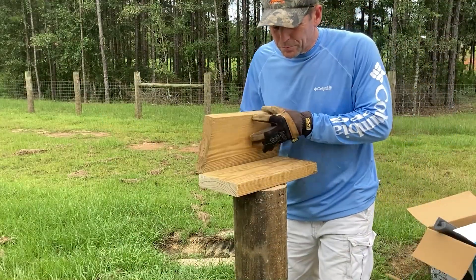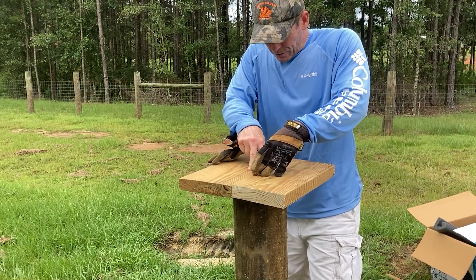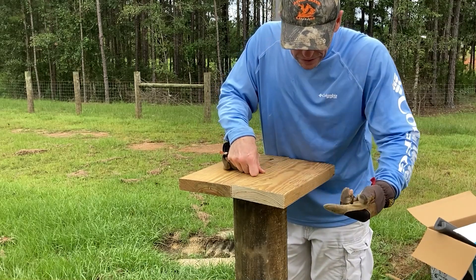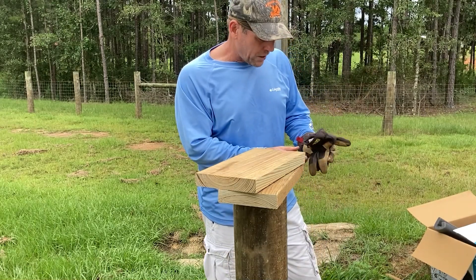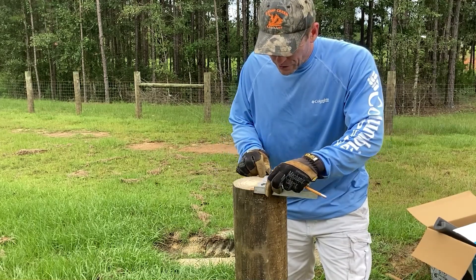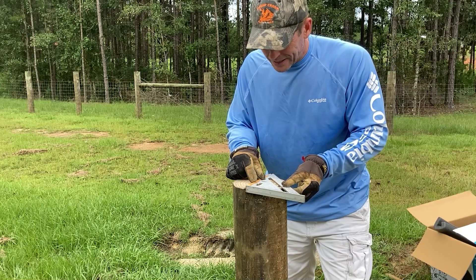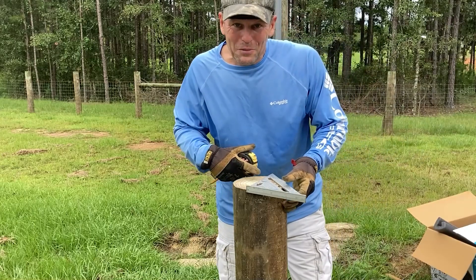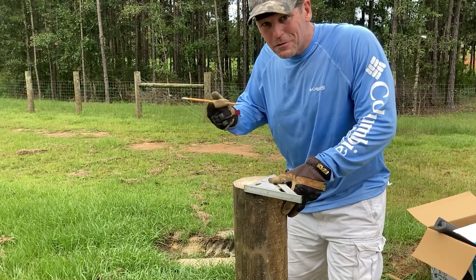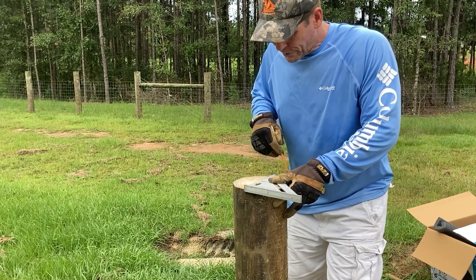I already pre-cut these boards — I think they were two-by-eights, I had to rip one down. They'll sit here screwed into the top of this post, and then the mailbox will sit on top of these and you screw the mailbox into the boards. I've got to pre-drill it because it's really hard treated wood I've had drying for several years. I want to square it up perfectly with the road, so I put a square on the post and sight it in, then go down the road and make sure it's parallel. I've looked at it from both sides and I think that's good enough.